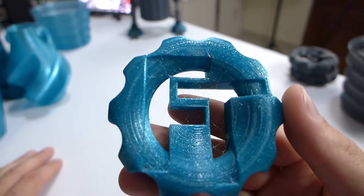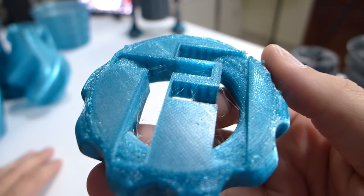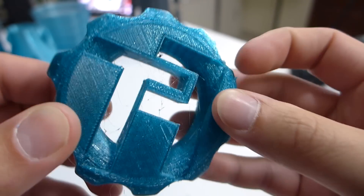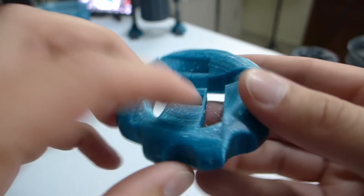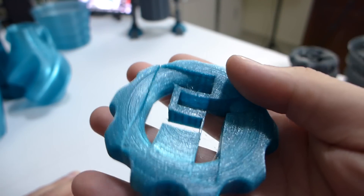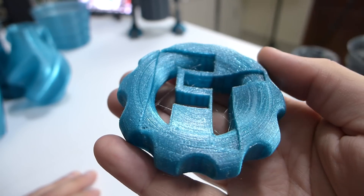Moving on to the teal — it has a great color. It's a little more blue in the video than it actually is; it's very green in person, but it looks really, really nice. It did very well on the supports, and you can see very little discrepancies in there. A little bit pimply down the bottom layers, which the gray had the exact same problem — big overhangs with no cooling. You do see a little bit of artifacts, but it was a good first layer. As you can see, it's a little stringy. This one turned out more stringy than the gray. The gray wasn't stringy at all.